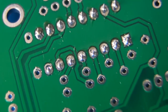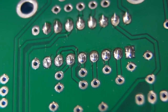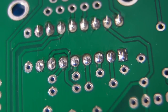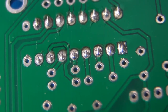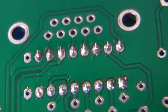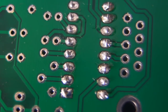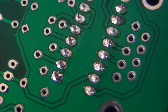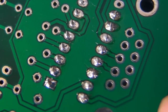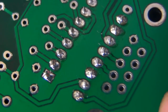If I wanted to do aerospace quality soldering, I wouldn't be using tools like this. You could even say that to solder properly you should actually apply flux — you can get all different types of fluxes, liquid, gels, and all sorts of things — to each individual joint. But for almost every purpose you're going to do, you won't need to go to that much trouble. You just use a good quality multicore solder with flux in it, a decent temperature-controlled soldering iron and tip, and some fine solder — and that's all you need.